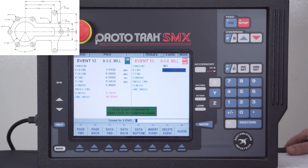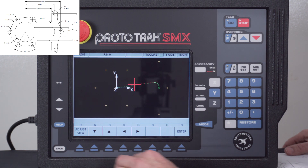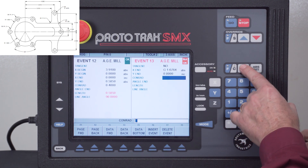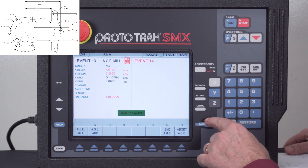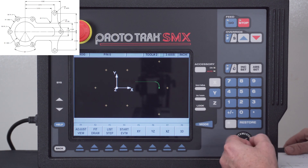There are two ways to use guess. One is to type in an approximate value — say about two inches — and that'll work. Or I can use the look button, which lets me drag the endpoint to approximately where it would be. If I do that and push enter, it fills in both X and Y. The disadvantage of this approach is that it also answers the Y, and I actually need Y to stay at zero incremental. There's no corner radius here, and there's no more information on the print to use. So even though it's not showing okay, I'm going to page forward — and when I push look you'll see a dotted line indicating where it thinks the endpoint should be.